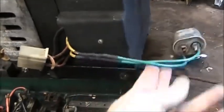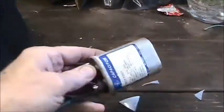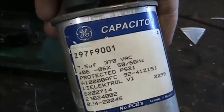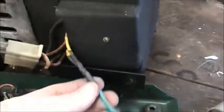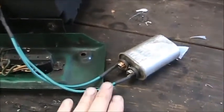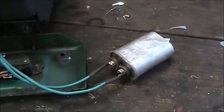The two yellow wires you see coming out, which I've spliced into, go to a 7.5 microfarad capacitor. The stock one is plus or minus 5%. When we get inside I'll show you where that had normally mounted — that's why the wires are that long. You're not going to find the parts for it, but this works fine. I put this on and it started producing electricity easy. It's just that this one's old, so I'm going to replace it. Those are usually less than $10.